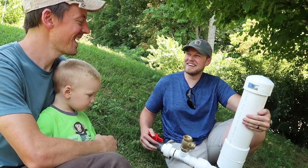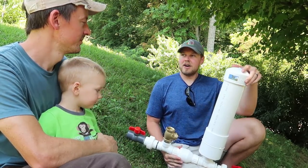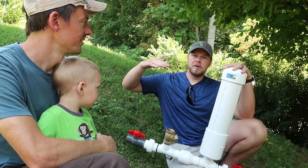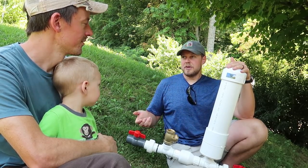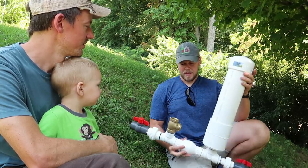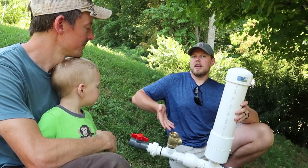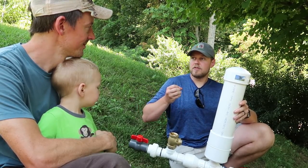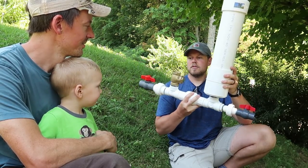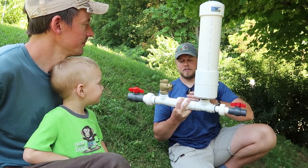So you're looking for ram pumps 101. Exactly. A ram pump is a means of pumping water from a creek. They work on head pressure or hydrostatic pressure. Let's say you put a pipe in the creek — it's coming down and there's a certain amount of drop, and that drop is your head pressure. The more head pressure you have, the greater potential you have for pumping water vertically. You're going to be creating a pressure wave. Water is coming down the drive pipe and it's going to hit this valve first — you can hear it pop. The water hits that valve and pops it closed. As soon as that happens it creates a pressure wave. Water is shot back up the drive pipe, but also goes into this secondary valve here, so water is pushed in and it hits this big wall of water going uphill — a pressure tank — and closes there.